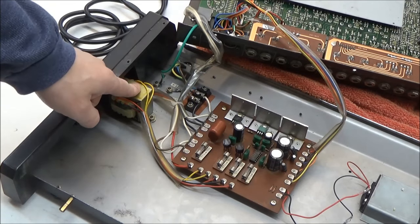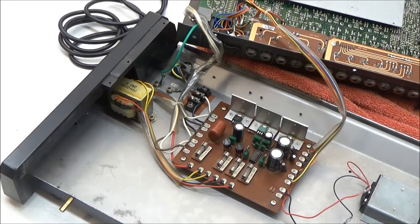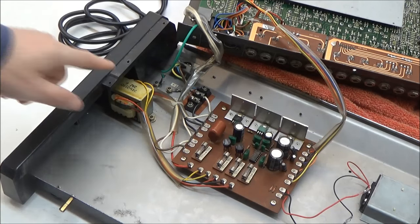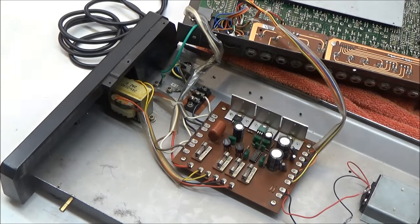Unfortunately, the power transformer of the 808 doesn't have dual primaries that would make this just an easy reconfiguration. You may have seen me in someone else's TR-808 video where I was designing some mods. His local tech had the original transformer rewound. I'm just going to replace the transformer with a new one that meets the specs needed. This is faster and cheaper than finding someone to rewind the transformer, and the net result is safer because we're using a brand new transformer, unmolested from how the manufacturer made it.